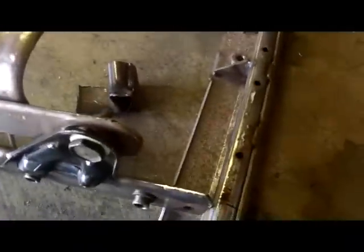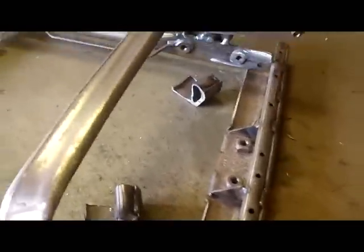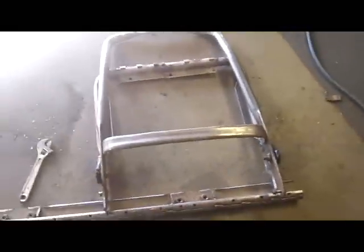And this is like a powder coat paint. It's a little pain to get it off, but when all said and done, I can sandblast that stuff off and clean it up, put it in some kind of paint, because I don't want to leave them bare metal like this. They'll go to hell in no time. Probably just like everything, an army green, and then upholster them and have fun. But these are the pieces that I cut out. No sense trying to butt weld those again when I could just make a whole new piece, right? And like I said, plenty of material, so here we go.